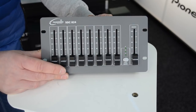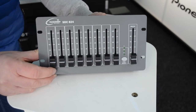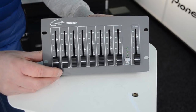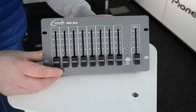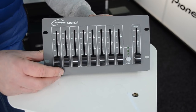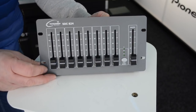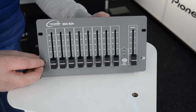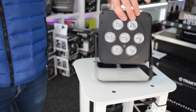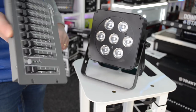When we do our videos and demonstrations of moving heads in the shop, we like to be able to show the gobos very quickly and show how bright it is, and we use this product. It's also great for controlling LED power cans — very simple to control, but again we can only do products that are the same. I could do eight LEDJ 7Q5s no problem, but I couldn't add a Chauvet Slimpar on the end of my DMX chain — that wouldn't work. So this is very limited but let me show you.